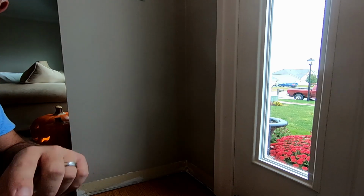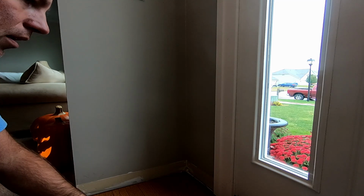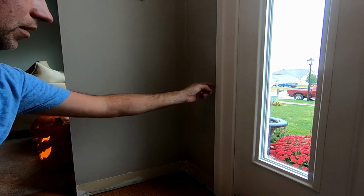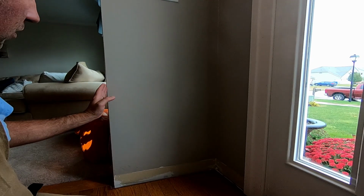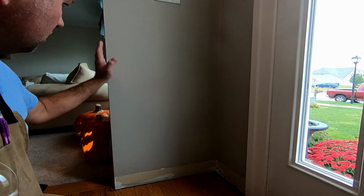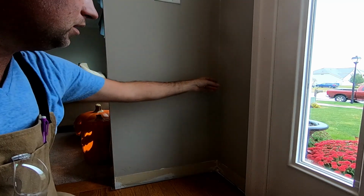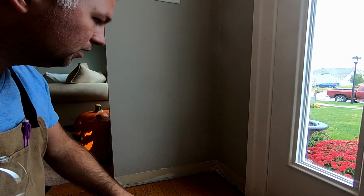When we get to some of the bigger walls, we're going to measure it off and see how many squares makes the most sense. So you'll see as we get going, but I just wanted to give you an update on these moldings being all in. So now we have this edge to work with to make all our measurements. So here it's going to end right here at the edge. So what I'm going to do is build this box first, and then I'll leave a little bit of a gap from this edge so I can line it up perfectly with this edge. And then this edge will tuck away, and then when we put the cap on it, you won't see any of it because the next piece will come across here, and then we'll just silicone that edge or caulk the edge. So it'll work out good.